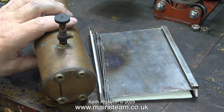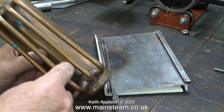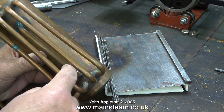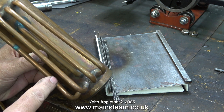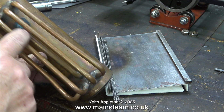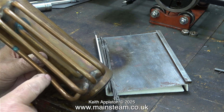The new Clevedon Steam panels are underneath the one that is burnt on the top, which shows the importance of having suitable heat insulation. I don't know where this top panel came from — I found it in the workshop one day. Taking a detailed look at the boiler: the tube in the centre is not a water tube, it is a super heater tube or steam dryer tube. The steam is taken from the top of the boiler down this tube and exits on the bush to the tap, passing over the fire again so the steam becomes very hot.